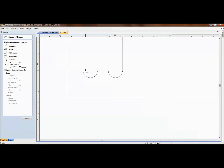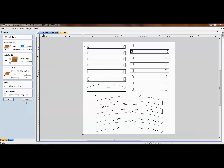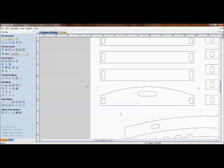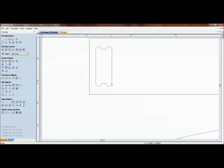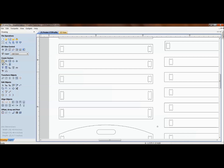A project like this would need modifying. If I had material that was 0.74 and the slot is only 0.72, it would not fit. I would need to resize the drawing, add tolerances or offsets. Now, why is the slot 0.72 if the material is only 0.71? You need to draw a little tolerance into your joint — the machine cuts so accurately that if you draw it at exactly 0.71 it could go together so tight it will not come back apart.